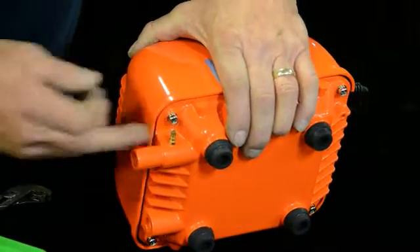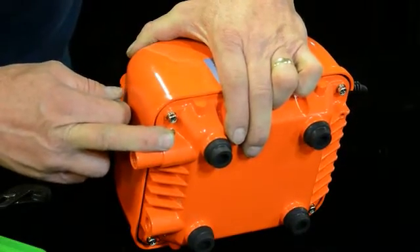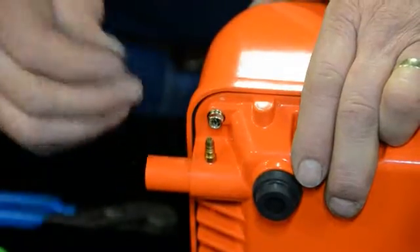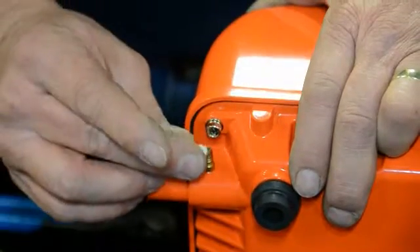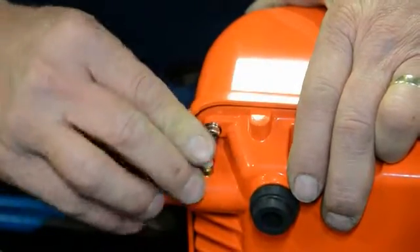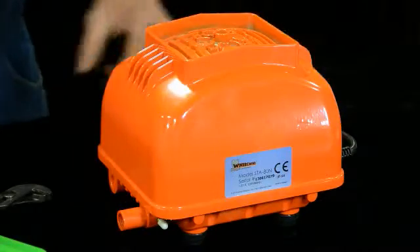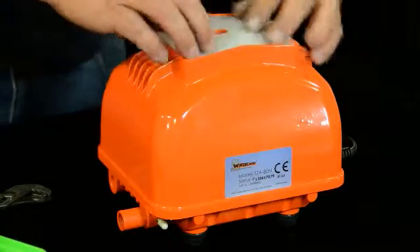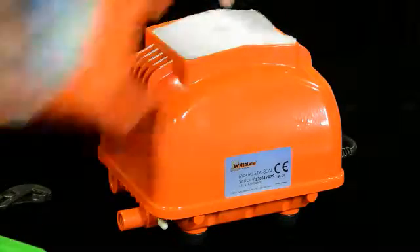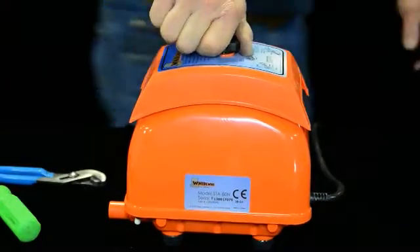This hose bib is for a low air pressure alarm. Some units have remote alarms — we have them with the alarm on there or remotely. So you want to put this plug on there if you won't need that for this unit. You only need it if you're going to have a low pressure alarm. Then take the supplied filter, put that in there — good air filter. Everything looks pretty good. Tighten her back up and we'll plug her in.